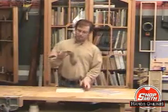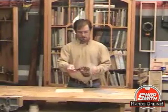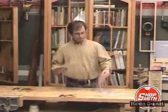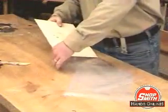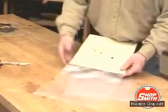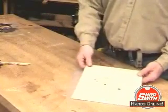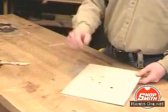Alright, this is what it is — basically a polyvinyl bag. And this is the wonderful thing about this: you keep using it, it just comes right off. What I've done is — and you can take a Ziploc bag at home or whatever — cut a little piece of plywood and slip it right on in there. For reasons far beyond my limited capabilities of understanding, epoxy does not stick to this. So this is one way of easily mixing and applying your epoxy to your project.